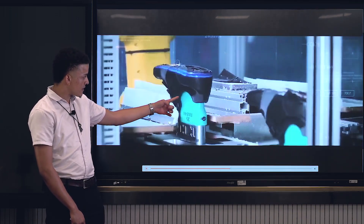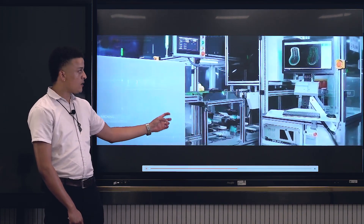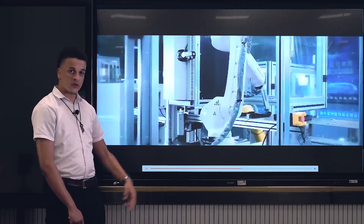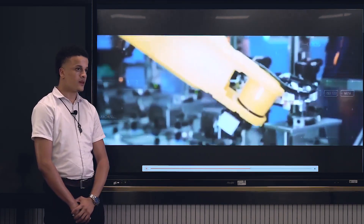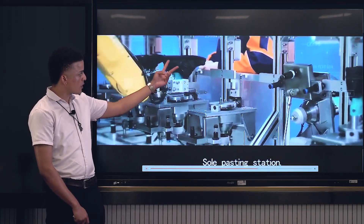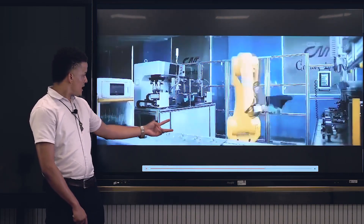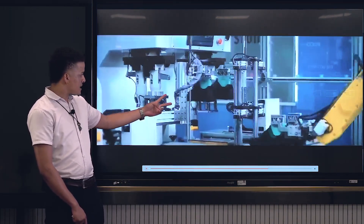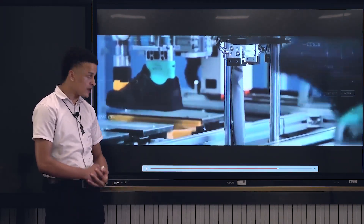As you can see, the machine is applying the final glue on the vamps. From here, the shoes are now transferred to the sole pasting station that has two people. The machine is giving the vamps and the soles to the two people at the sole pasting station. Then the finally pasted shoes are brought back to the bottom pressure station where they are being compressed and pasted well.